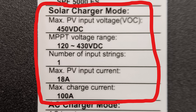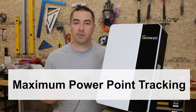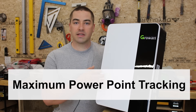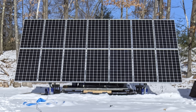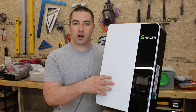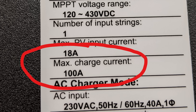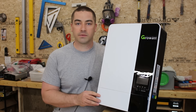The second big feature of this is that it is a solar MPPT charge controller. MPPT stands for maximum power point tracking, which means you'll get more efficiency and you can use a high voltage array — in this case up to 450 volts — which decreases your wiring size, combiner box, and things like that. This charge controller can charge a battery up to 100 amps from the controller into the battery.